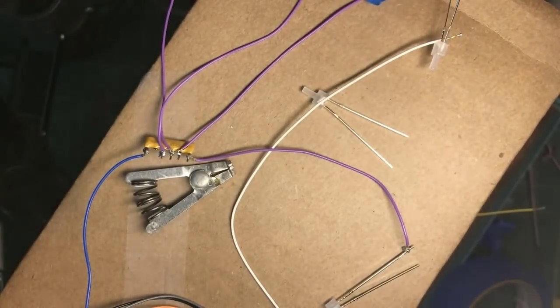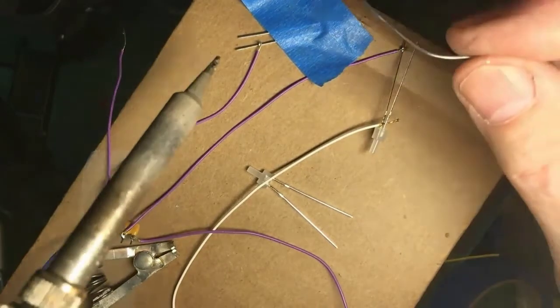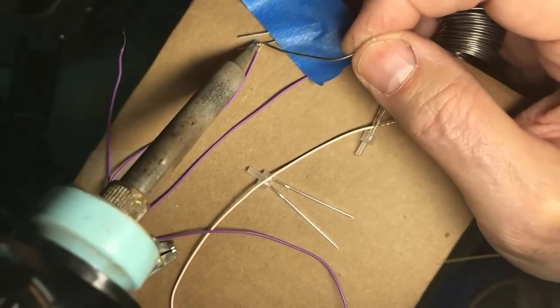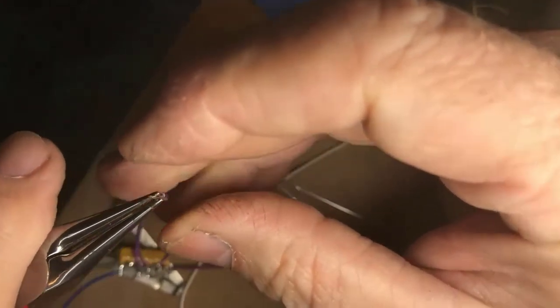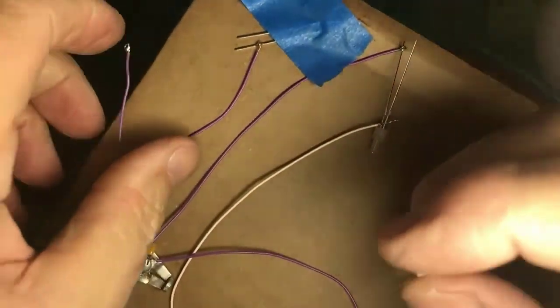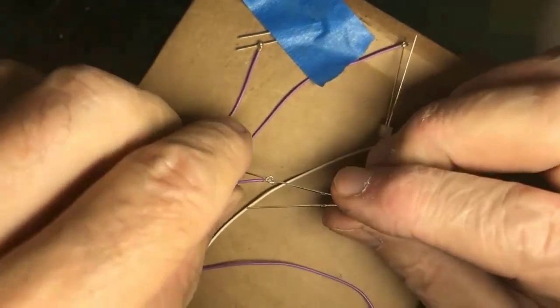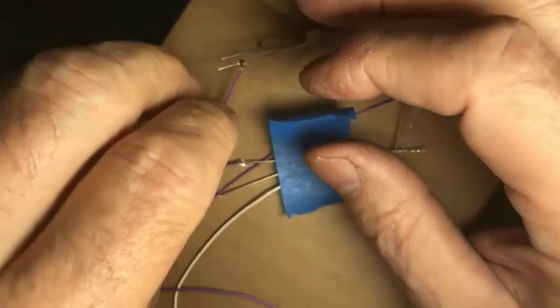But then again, okay, so it's tied down. Again, the long lead, there it is. The long lead, apply to the work, apply some solder. Last one, getting close to actually making this work. By the way, the decoder is already programmed and is sitting over there, ready to be plugged into this mess. I'm not plugging the decoder in while I do this work, because why subject it to the abuse of being near connections and soldering irons and everything else?